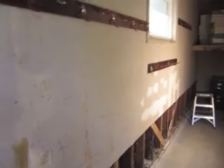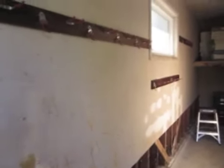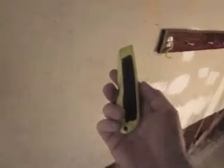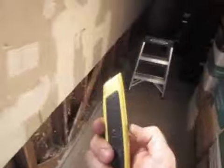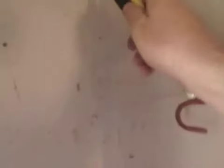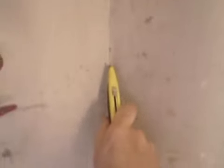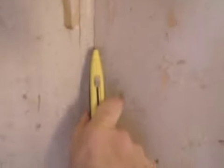Here's how you do this job. The first thing you need is a regular carpet knife. You can see we have our carpet knife here. You go around all the edges — it makes sense to start in the corner first. You can see here's the room, and you start in the corner, get the blade up in there, and you just run it down the wall, like so.